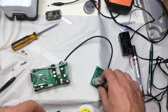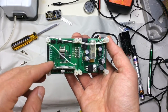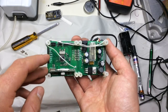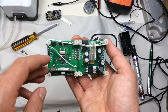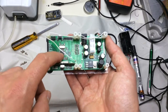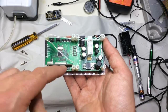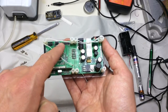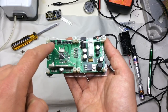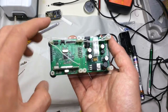Everything is fed up through that header — there's a matching socket here — sending up high voltage, a couple of ground connections, data, load, clock, and output enable. All of these feed directly into the shift registers, along with a 5V supply to the top board. This board contains an ATmega328P programmed with the Arduino bootloader, so this is basically an Arduino clone. It has the standard FTDI Arduino programming header, an in-circuit serial programming header for directly flashing the bootloader, and a reset button.